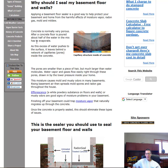Concrete is very porous. When you pour a concrete floor it has a lot of water in it, and most of that water evaporates in order for the concrete to harden. As it evaporates, it creates a pore structure — a capillary structure — kind of like miniature veins. Those pores are smaller than a piece of hair, but they're large enough to let water molecules, water vapor, and gases flow easily right through them.